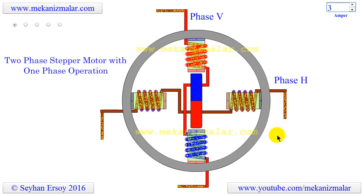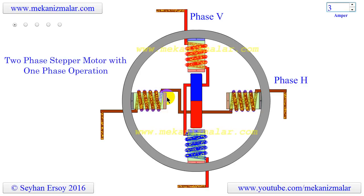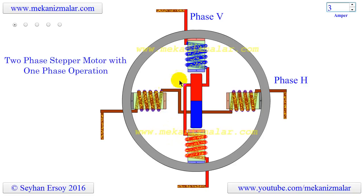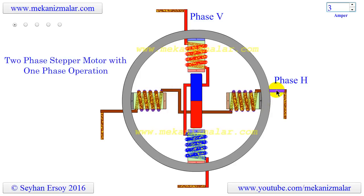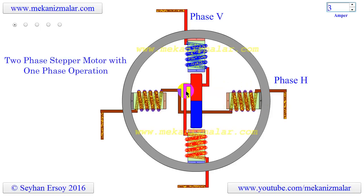To understand the polarity of a coil, I use red and blue color for coil windings. The polarity colors are based on the face of the coil closest to the rotation center. If the coil has red color, the face of the coil looking to the rotation center has north polarity. Similarly, if a coil has blue color, the face looking to the rotation center has south polarity. I use red color to indicate the presence of current and brown color for the absence of current.